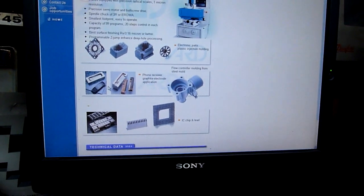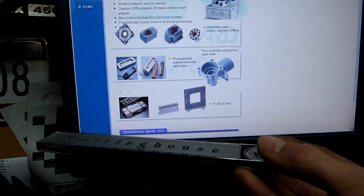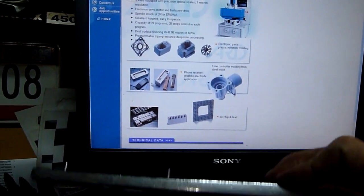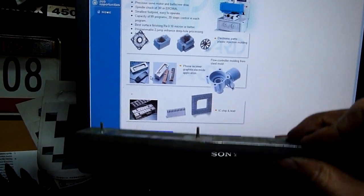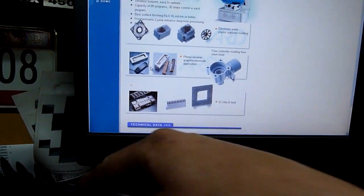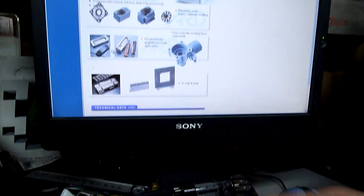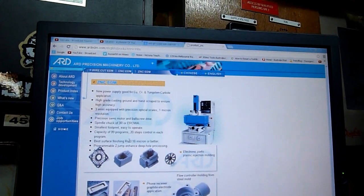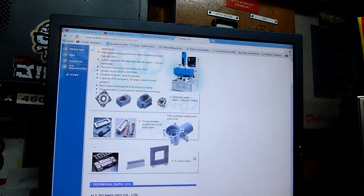If you wanted to make a raised letter aluminum die casting, you could mill it out of copper on a CNC machine as a negative, machine the bulk of the material out on the mill, and then plunge it into a block of tool steel with the EDM. You'll have all the lettering already done with tapered edges for releasing the material so it doesn't drag on the mold and get stuck. They're fantastic machines - best surface finish is 0.16 microns or better.